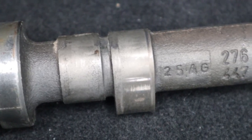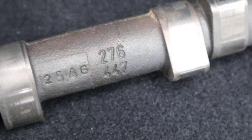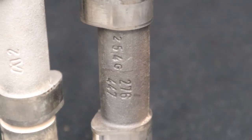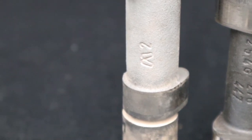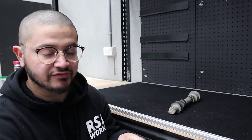When it comes to the dry ice blasted journal, it only shows the wear and pitting that was there in the first place. Dry ice cleaning will always bring a surface back to its original state — it's not going to improve it or change the surface texture in any way. If you look at the camshaft end that has been dry ice cleaned, you can see a significant difference in texture; it looks far more natural. Dry ice cleaning lends itself to a more natural finish — as-intended from the factory. With a couple of years of oil saturation, the cam might have been a little lighter, but otherwise it would have looked very similar to the dry ice finish.